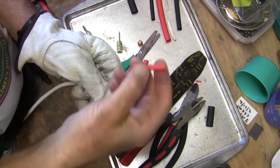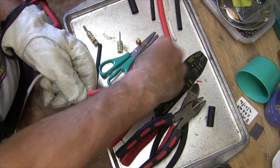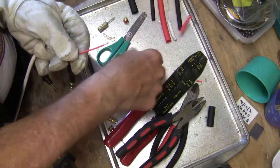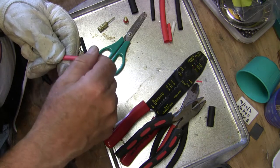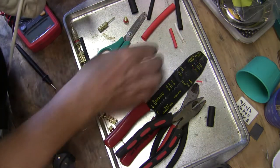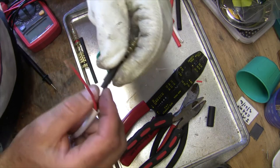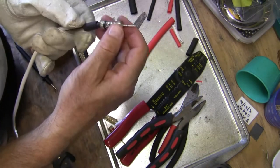So I got this ready to go now. I take the smallest diameter shrink tubing and put that over first — I cut that a little bit longer than the other one. Here's the medium-sized one that goes over here. This one's about a little over an inch; the other one's about three-quarters of an inch. Once the connector's back on, I'll put this over it. The black side's all ready to go. The smallest one's a little bit longer so it'll shrink better. Then we take this bigger piece and shrink it on top — so it's kind of a three-step process.